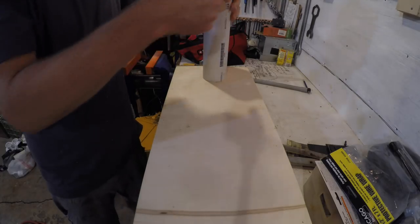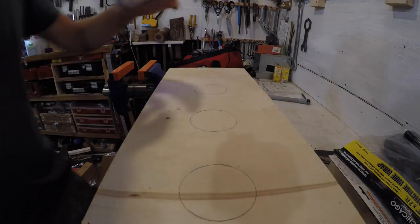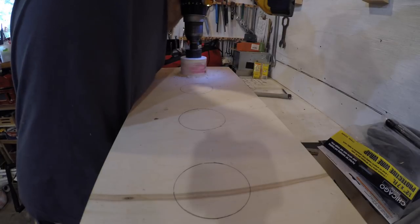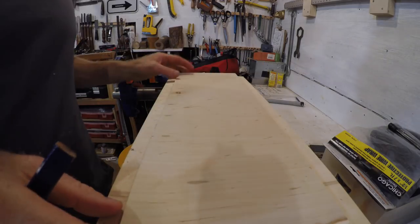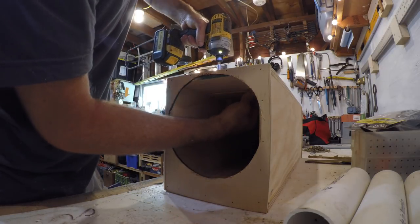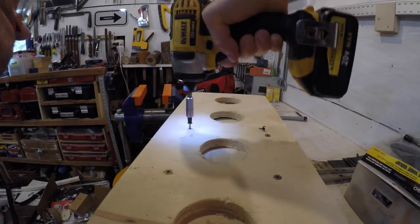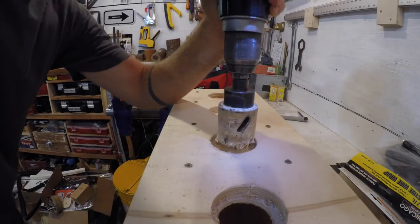The drying tubes go up on top. I drilled four holes using a hole saw that match the PVC diameter, then added a piece of plywood under the holes and drilled some smaller holes. That creates a nice little ledge for the PVC pipes to sit on, so shoes or boots on those pipes don't push the pipes down into the air box.